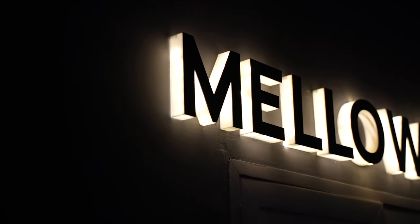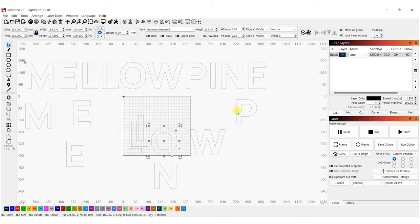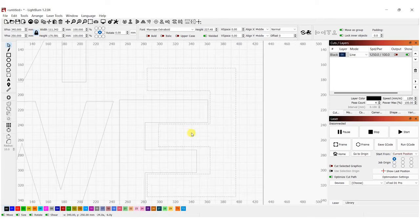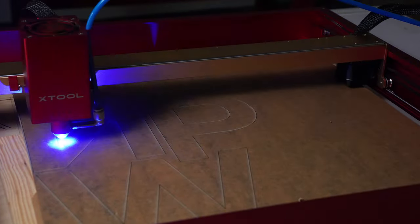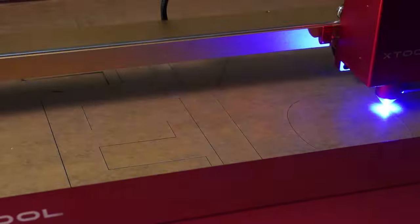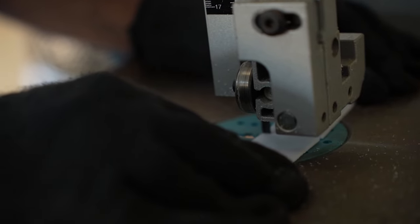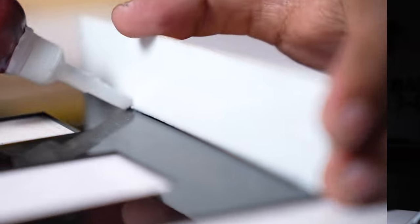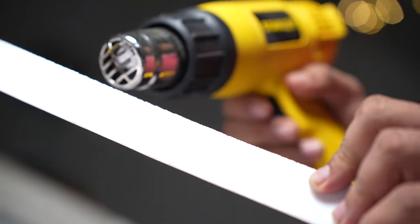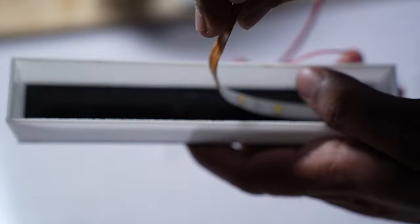Now I'll show you how I made a signboard. I used Lightburn for the letters — since there weren't many good fonts available, I downloaded some from the internet. I first determined the size of my signboard, which turned out to be 5 feet in length. The Xtool D1 Pro has a cut area of 400 by 400 mm, so all letters wouldn't fit, and I split them into two batches — you can also cut letters one at a time. After cutting, I used a band saw to cut long pieces of white acrylic for the side walls, then cut them to the right length and glued them onto the letters. For curved letters like P and O, I used a hot air gun to heat and bend them to the right shape — you can also use hair dryers or hair straighteners, but don't bend without heating or it will snap. Once the letters were ready, I placed LED strips inside and wired it all up.